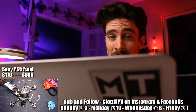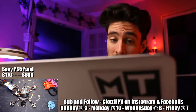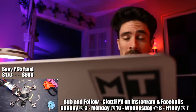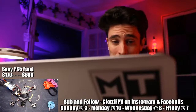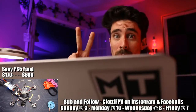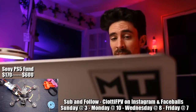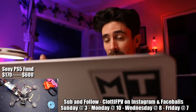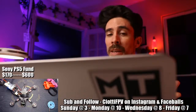And then the beacon strength, that is the volume of your ESC beepers. I turn that up quite a bit on micros because they're fairly quiet. I'm moving it up to 130 here. I'll usually do like 120, 130. Beacon delay, I drop that down to 2 minutes, which means that if for 2 minutes the ESC has not received any signals, it just starts beeping saying, hey, ESC is running and I'm getting hot. Either unplug me or fly me, you fuck.